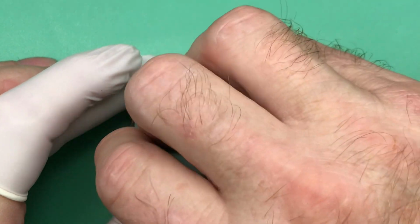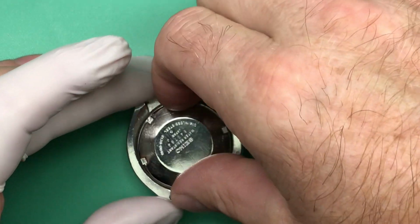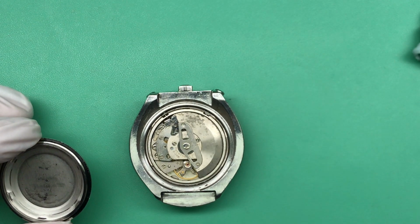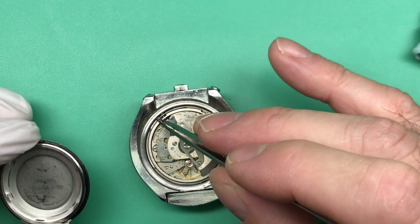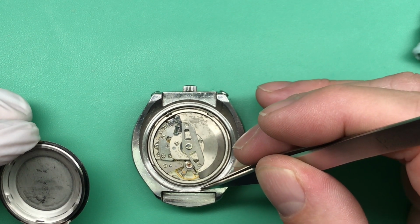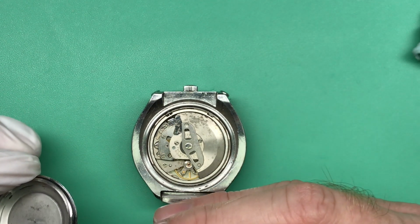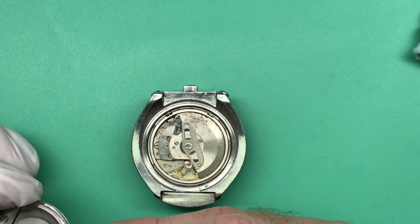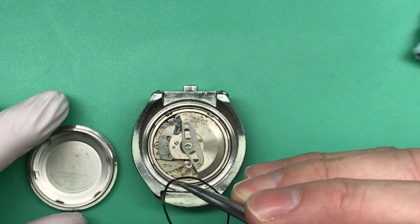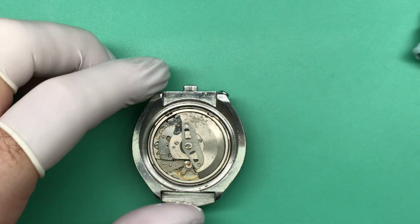So one thing I really want to take a very close look at are your sealing surfaces to see what kind of shape they're in. Overall in your case, they're pretty good. You got some minor corrosion here. The good thing is that it doesn't traverse inward. We'll check under this incorrect gasket. Case back surface is nice, so that's good. That's always good.